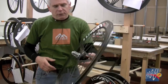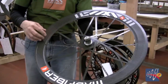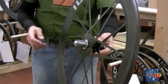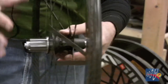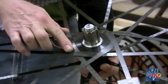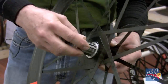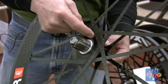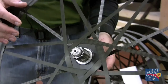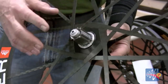Let's take a look at a rear wheel. It's very similar to a front wheel in that it has these ribbon spokes on both sides — there are a few more of them, of course. This pattern you see is to transmit torque from your pedaling out to the rim. We've got a titanium free hub made by Doug White in Petaluma. Like the front hub, the wheel is tensioned by pulling the two halves aside. The spokes all nest very neatly outside of this driver. Your pedaling twists the free hub body, which in turn moves this driver. The driver moves this nest of spokes, both with a bond that you can't see, and also with this hexagonal shape — the hexagonal shape of the black piece drives the hexagon pattern of spokes around it.